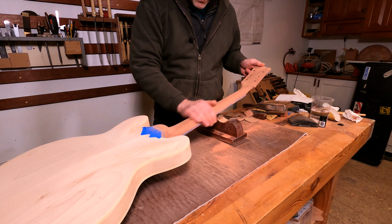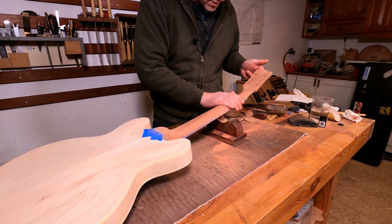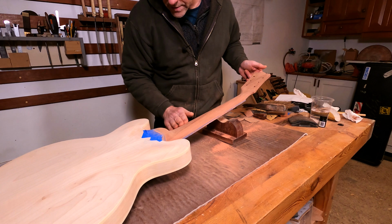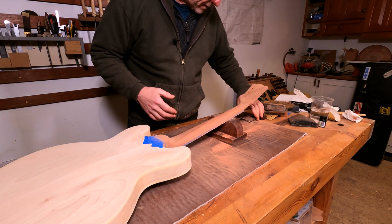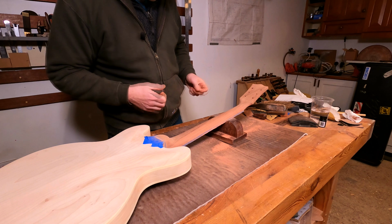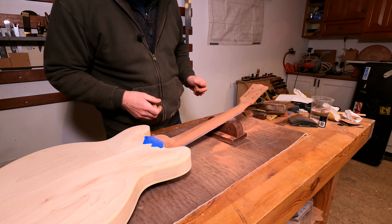So that's all been rubbed down now to 400 grit, wet and dry, so it's feeling nice and smooth, and you can see there's still filler in the grain. So I'm just going to give my hands a quick wash, clean up the work area, get rid of as much of this dust as I possibly can because it will stain stuff, and then we can take the masking tape off and have a look and see how close we are.